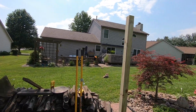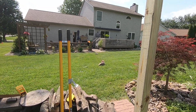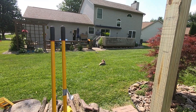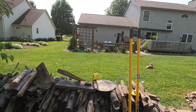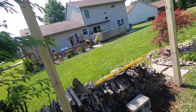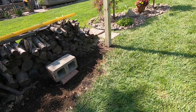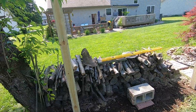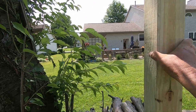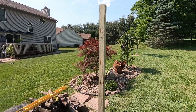We could do all kinds of stuff with it — we could put more stuff in the center and build a shelf. Finnegan's pulling guard duty over there. It's a little windy; he doesn't like the wind. Waiting for the concrete to set. It may feel pretty sturdy, but I put a bag of 25 pounds of Quikrete in each hole.